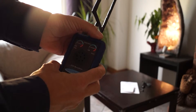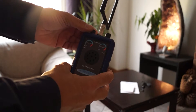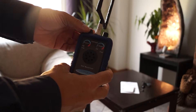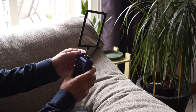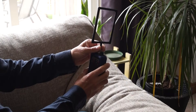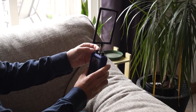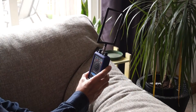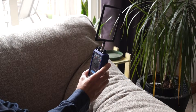Then we are going to turn on the speaker volume to about halfway, turn on the power switch, and adjust the intensity. With the AR1 on, adjust the antenna position so that it has no feedback. Adjust the power and volume controls until you can hear the clicking in the background — that is the distant clicking of lightning bursts, perhaps 1000 kilometers away.